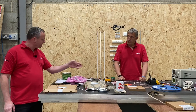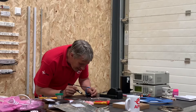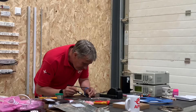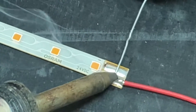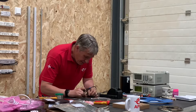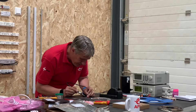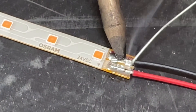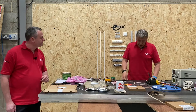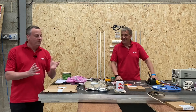So this time the cable ends are ferrulled, which removes the conductor-tinning step. The tracks are pre-tinned and ready to go, so you just make the final connections. The uninsulated ferrules are incredibly cheap, so it's not an expensive process. There we go — both connections done. That's an E-Fix top tip: try using ferrules.